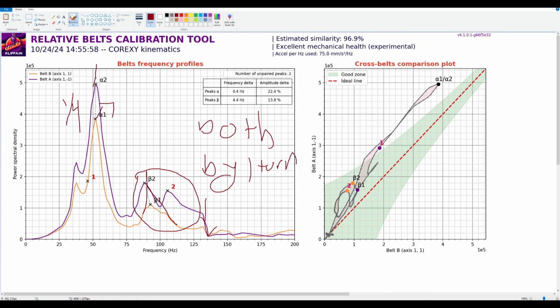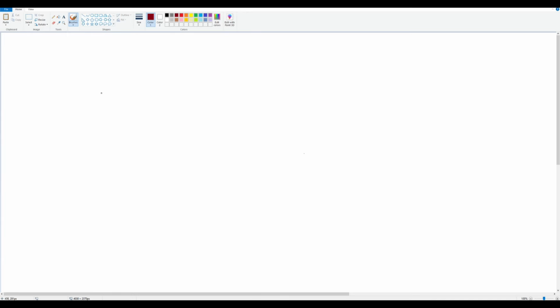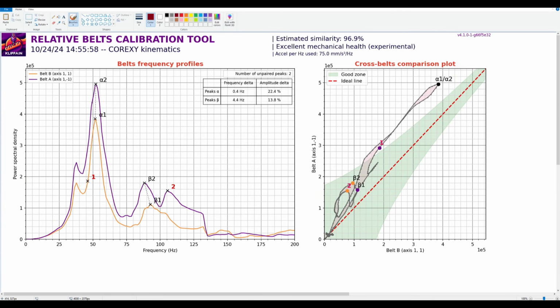Now, if I see this guy go up higher, and these go up higher, and these go up higher, when I try to tighten this belt this way, so that's a quarter turn on B, what this is telling me is I'm not helping the situation. It's racked. Probably belt induced racked already. So what I would do here is I would just loosen the belts and start over. Because you're going to keep trying, you're going to be like, oh, I did tighten B a quarter, but if you go back to this...